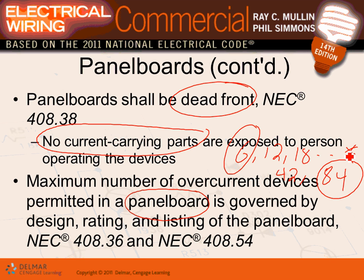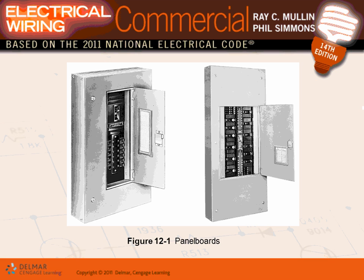There are a few requirements that require you to limit. For example, if you have a panel, guys, and it doesn't have a main and it's a service, you are limited inside this panel. If here's my panel coming in, main lugs only, you're limited to six of them because that's a six disconnect rule. Can you see that? This is an exception: I bring in a service here, and no main to the service, I'm limited to six disconnects. So that's a limitation on how many you can put in the panel. But that's not your lighting and receptacle panel, typically.